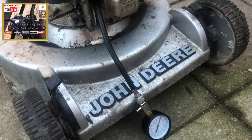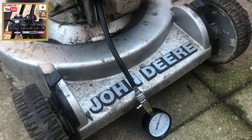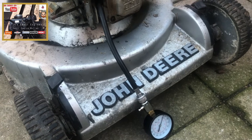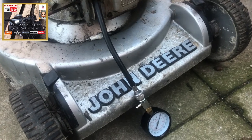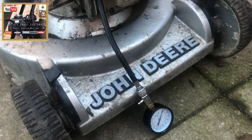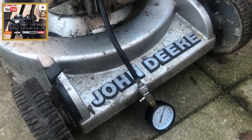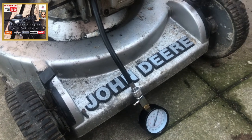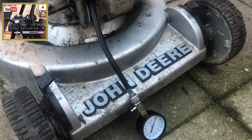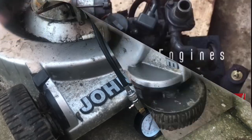There'll be no further work on this at the minute — I'm going to have to work through the backlog of other machines I've got out in the yard. I just wanted to prove that there was compression there, and we've got 60 psi, but it's not enough for it to fire. The purpose of this video was: when there's no compression on an overhead valve, initially check your valve clearances and ensure the valve stems are seated correctly and in situ. Take care — half an hour's work.